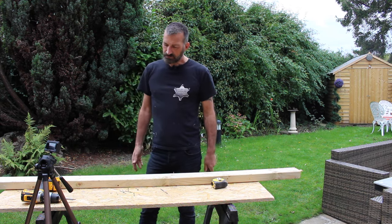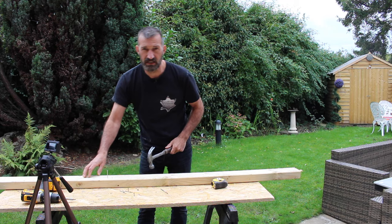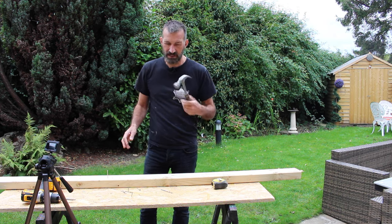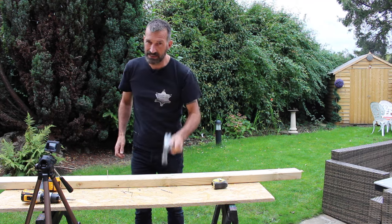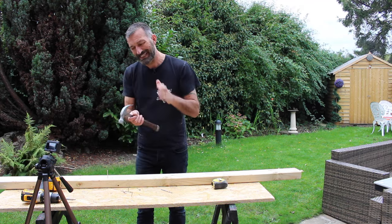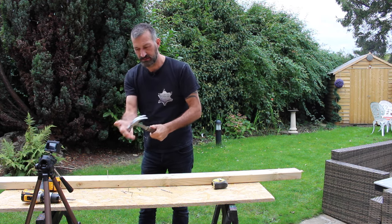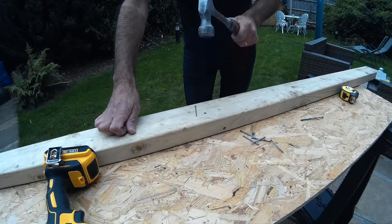There we go — very simple. You do the same movement all the time. In a way it's like a golf swing: once you have your set swing, you just change your club. Here you might use a lump hammer, a sledgehammer, or a ball peen hammer — it's the same movement. The strength comes in lifting the hammer, not hitting it. When you lift, the weight of the head does the work. Up, down — nice and relaxed.